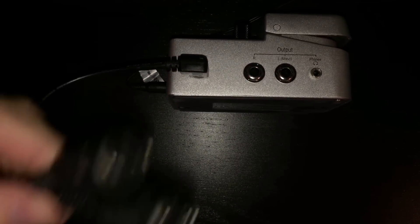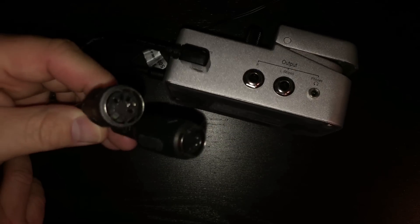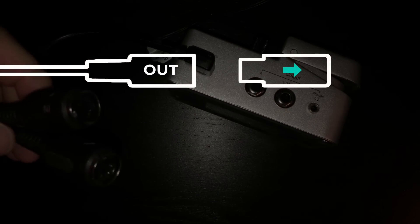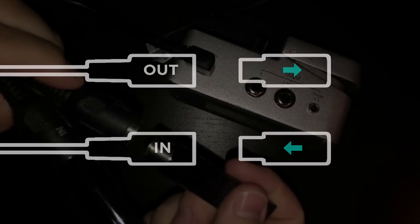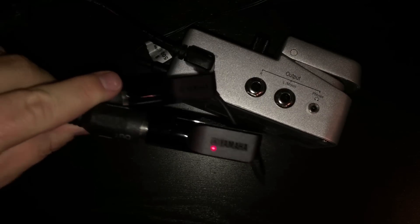The tricky part with these is connecting them to the correct wires. Be sure the little arrows on the dongles point the correct way. You want the out cable connected to the dongle so that the arrow is pointing away from the MIDI out port, and the in cable connected so the arrow is pointing towards the MIDI in port. Once connected, the dongles are powered by the MIDI ports themselves so you just need to plug them in and they're ready to connect in OnSong.